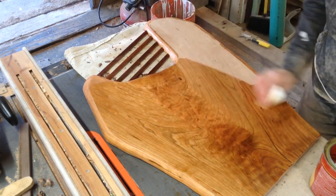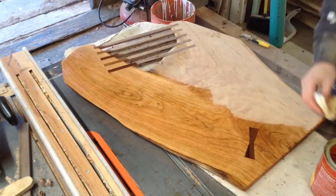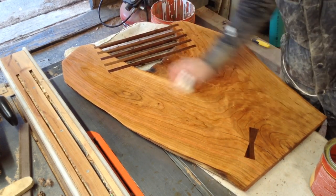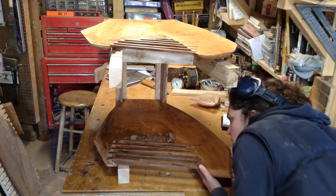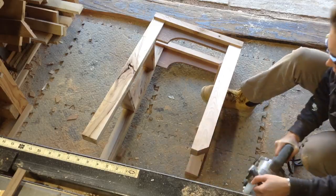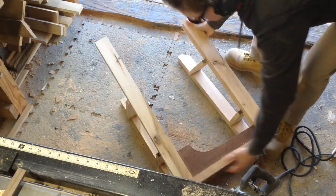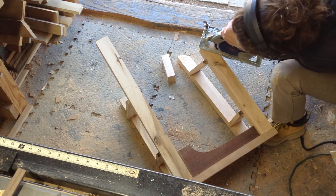These actually do have the finish on them and they're done. I put them back into place so I could cut the top. I'm trimming these arms so they don't stick out, and I'm also putting little 45-degree cuts on the bottom so that it creates a nice sense of lift off the floor — it won't look as flat with that angled piece at the bottom. With that cut I could test the cherry back in place, and then these cherry slabs were going to be leaving the next day.